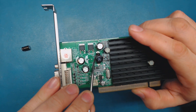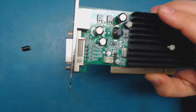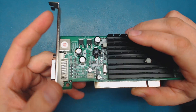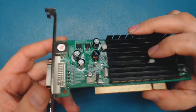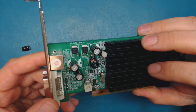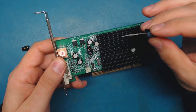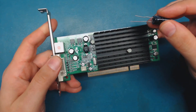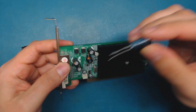If you look here, this is right off the coil, so I do believe this capacitor has seen a lot of taxing from this PWM — it's probably why it failed and why it's probably the first one to fail, because it's actually probably the first capacitor in line to smooth out this PWM. Without a schematic I'm totally speculating, but I'm going to try this capacitor in here and see how it goes.